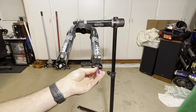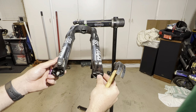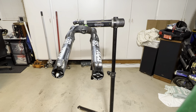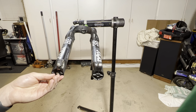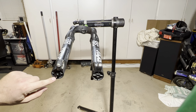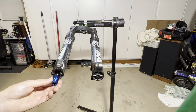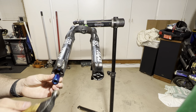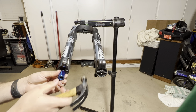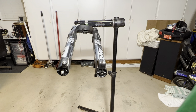Take the nut back off — it's already wanting to separate. We'll do the same thing on the other side with the 15mm nut. Thread that back on and be careful: on the edge of the damper is your low-speed rebound setting, so you do not want to strike that with the hammer. Put the socket over it so there's no possibility of it getting bent when you're tapping on it. Once both sides are separated, we are ready to drain the fluid.